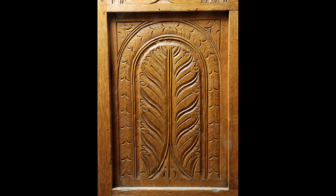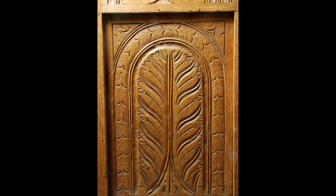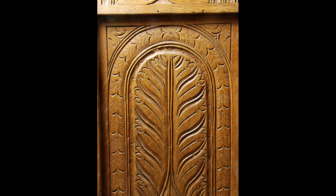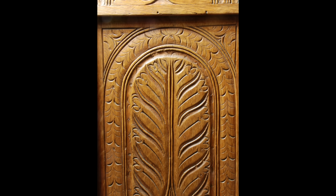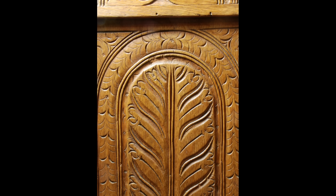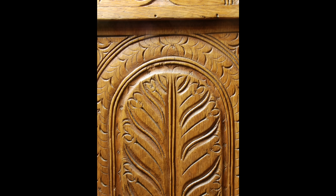The main infill of the arch is a sort of leafy shape. Those S-curves are formed with a v-tool and then a shallow, narrow gouge beveling on each side of those to give depth to this carving. All the accent stuff is cut with the same gouge that did the seagulls around the arch. Punctuated here and there with the Maltese cross. No blank surface again — it's classic 17th century stuff.